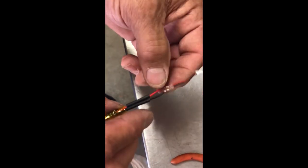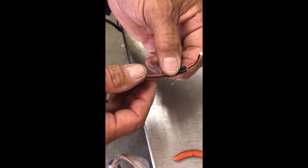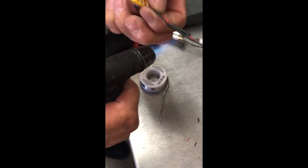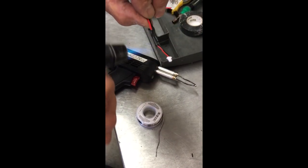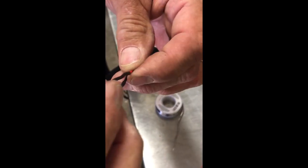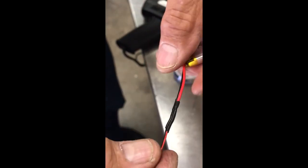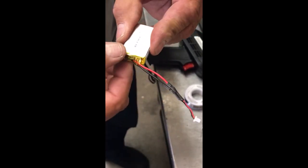Now they're soldered together as you can see, and yes I do have a little wire sticking out but that's okay. I'm going to pull my heat shrink tubing over it. I've got this little handy-dandy tiny torch and I go real careful - you don't want to overheat or you could burn through your insulation on the wires. I want to make sure they're good and tight so that there's no chance that if any water got in there you could have a short. So we're going to go back in the house and assemble this unit.